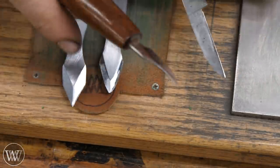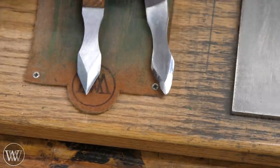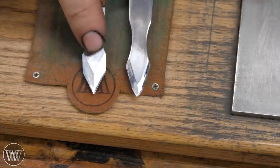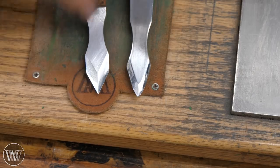I'm not going to be talking about those two today because they're fairly straightforward — they're just like any other knife. So today we're basically going to be talking about these: the standard double bevel marking knife. The interesting thing about these is you have to treat them as if they are two separate chisels rather than one knife. I want to take you through this and show you my sharpening method in one swoop and show you the whole thing in real time.